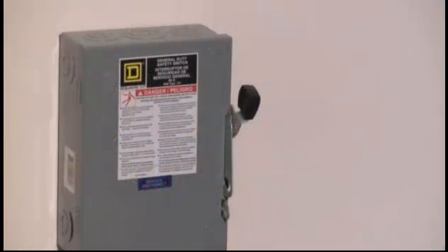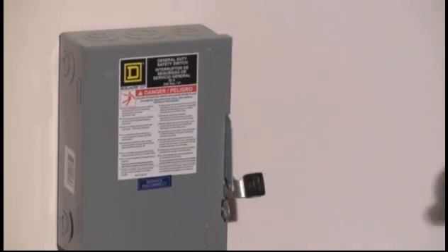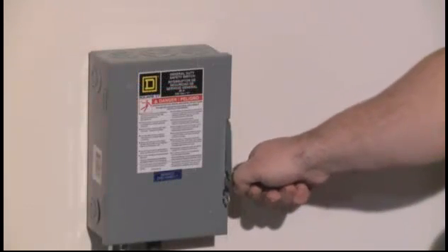The easy fix for these scenarios is to turn off the outdoor power for 3 to 5 minutes. If there is an indoor disconnect, make sure that it is in the on position before reapplying power to the outdoor unit. This will reset the error code and allow the unit to resume normal operation.